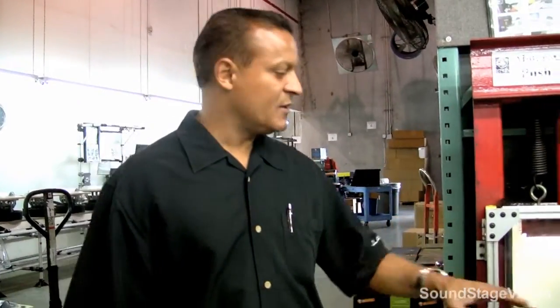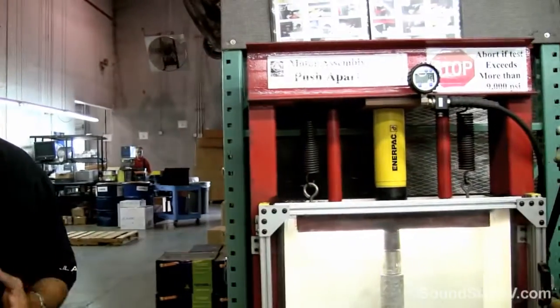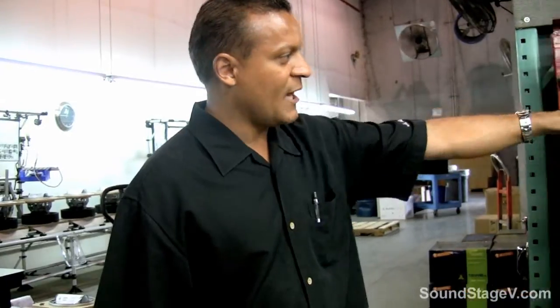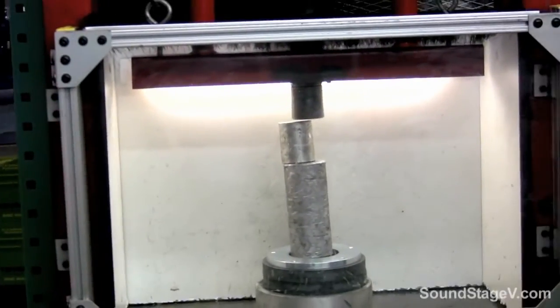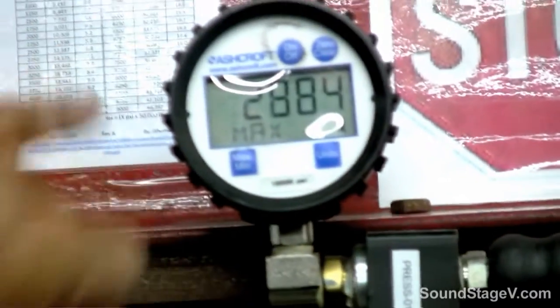What we have here is a 10W6 inside this chamber. We're going to perform a motor assembly push-apart test. We're checking the integrity of the adhesives to ensure the magnet is not going to come apart at any given time. Hector is going to push down on the bowl and cylinder. We're looking for the substrate material to break apart — specifically, the magnet versus the adhesive — to confirm the adhesive integrity is working as it's supposed to.